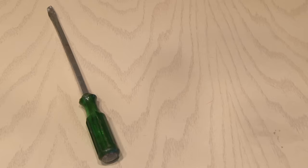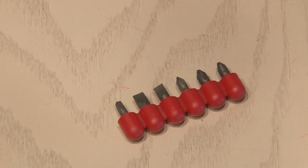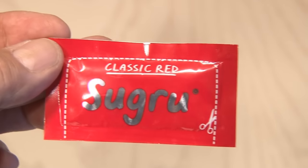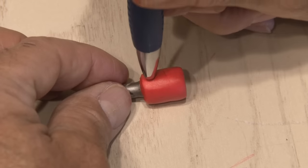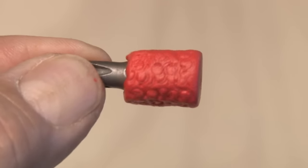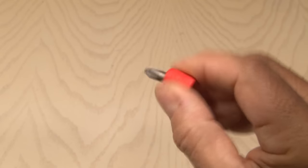Number four. There are screwdrivers in just about every shape and size, but it never fails that I need a tiny screwdriver with a small handle to fit in a tight spot. I've got these small screwdriver heads for my drill, so I decided to make some mini screwdrivers using Sugru. I took a small piece of the red Sugru and started molding it around one of the screwdriver bits. I rolled it on my table to get it uniform and smooth, then used the head of a closed ballpoint pen to put marks in it and give it a texture. After waiting 24 hours, the Sugru had hardened and gave me a nice handle on this mini screwdriver. This will be perfect for those tight spots.